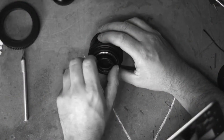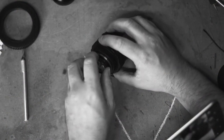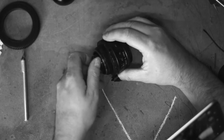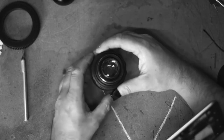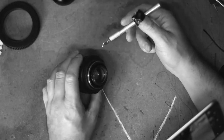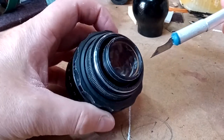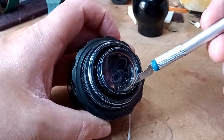Next is the other washer. You need a lens spanner to place this one, but once you've opened it, you can leave it. It doesn't need to be messed with again. As you can see, here there are two notches on each side of the ring. But there are two rings, an inner ring and an outer ring. The one we want to open for this is the inner ring. This is where the 1.04 millimeters washer will sit.